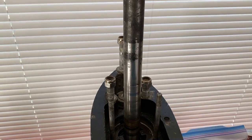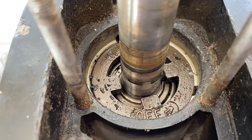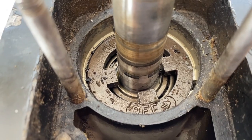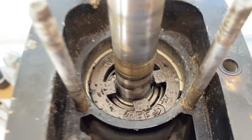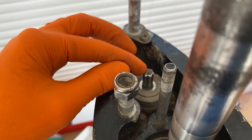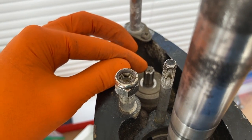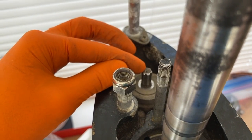Coming to the top of the lower unit, there is the drive shaft — it feeds all the way into the actual drive shaft retainer nut and into the lower portion of the unit. You can see the word 'off' with an arrow pointing counterclockwise to loosen. However, right behind that is our shift shaft. Before moving on we want to verify that the entire lower unit's gear settings are in the neutral setting — not in forward gear nor in reverse gear.